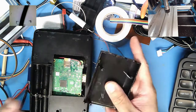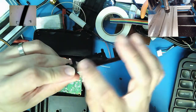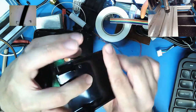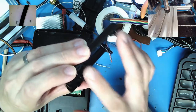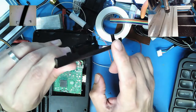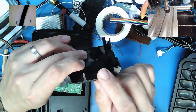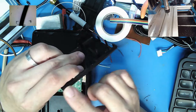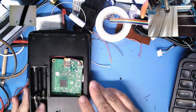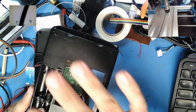So on the CNC later I'll mill off. I don't actually need that much height out of it, so I might cut all the way down to the surface. I'll cut down these standoffs here for the hold down screws, and then zing off this whole area. I'll get the Z height off of here and slowly come through and cut it evenly all the way around, at the same height all the way around. I don't need much, because when you close this up, the PC board is basically flush with the surface, so it just needs to be barely bumped out from there.